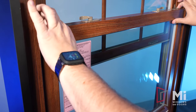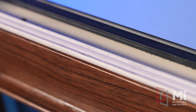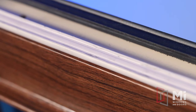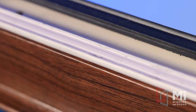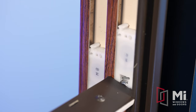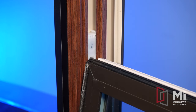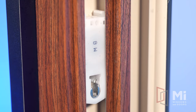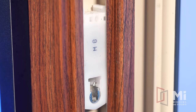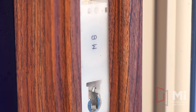The tilt sash allows for easy cleaning and ventilation of both top and bottom. Plenty of weatherstripping wherever vinyl touches vinyl, along with a double compression polypropylene bulb seal that's UV resistant and ensures a tight seal when in the lock position. The inverted constant force balance system allows for safe sash cleaning while providing a quiet and smooth operation when raising and lowering your sash. The state-of-the-art balance system requires less operating force while providing strength and versatility on bigger-sized windows, such as windows with offset sash or windows using triple pane or tempered glass. The coated stainless steel coils resist corrosion and enhance long-term functionality, and the coils are encased in a plastic box, protecting them from dust, dirt, and construction debris.